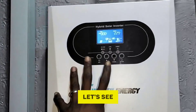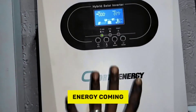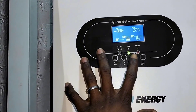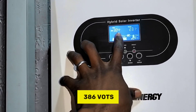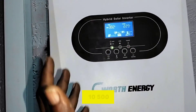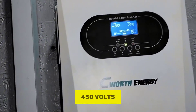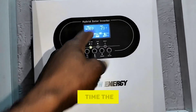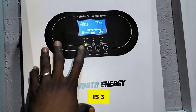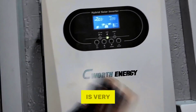Let's check the energy coming from the solar panels right now. On the roof we have about 5 kilowatts of solar energy coming to this inverter. The display shows about 386 volts coming from the panels. With 10 × 500-watt panels in series, we expect at least 400 to 450 volts — this is 10 o'clock in the morning so voltage should increase toward 400 volts with time. The PV current right now is 3 amps, partly due to the long cable distance from panels to inverter.